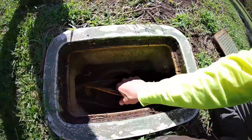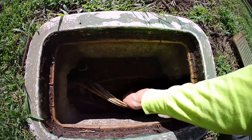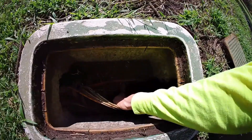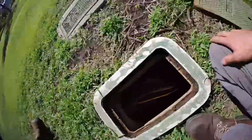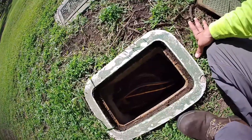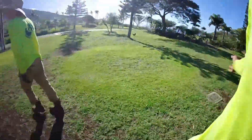Here's our feeder. Remember, not this yellow stuff — this is data. Here's our feeder in here. Now see how close these conduits are together, which will make it a little bit hard to pull out. But if we're using the tug around one end, it'll make it a straight through. But we might find that this is the location where we pull the middle out.